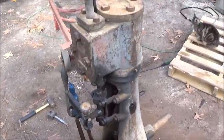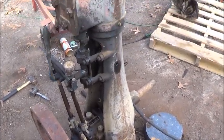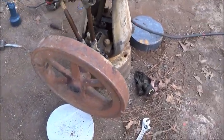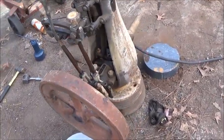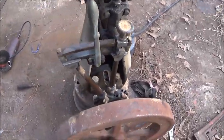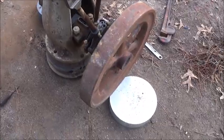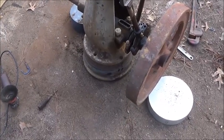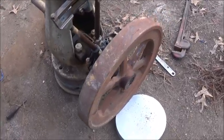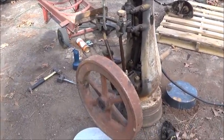We got this little engine running - seems to be doing pretty good. I had to put a flywheel on it. I didn't want to go over center because it was so tight from sitting. Got it all oiled up good, it's freeing up now, but we're probably going to leave a flywheel on it - it needs to have something, not a big one but something on it. This was probably a yacht engine or a boat engine that ran a prop on a shaft. The reversing gear seems to work good - I think that's Stephenson linkage. I've got a couple of drums there and it's not doing good, so we're going to build a base for it.